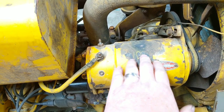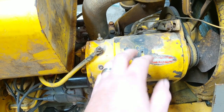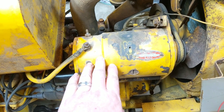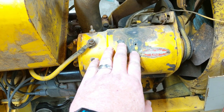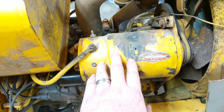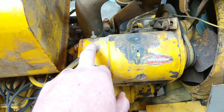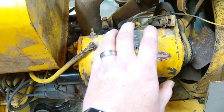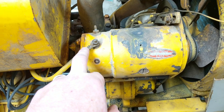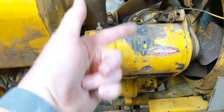This tractor does not have the regulator on it. I've actually been using this tractor and just swapping the battery out. It's a parts tractor — the clutch went out on my main tractor and I haven't had time to fix it yet, so I've just been using the parts tractor to mow the lawn. This is the hot wire for the starter, and an easy way to check these out is to simply take a set of jumper cables and put one on the positive terminal of the battery.